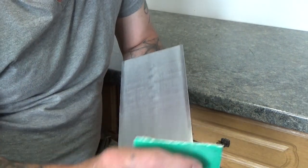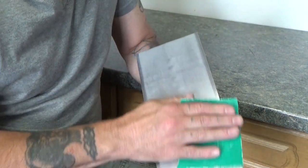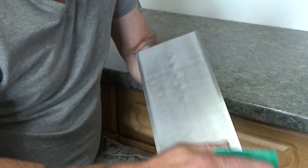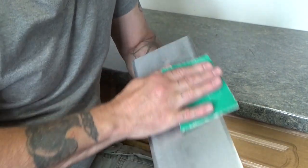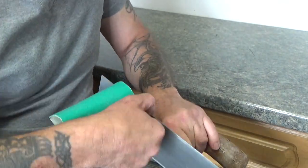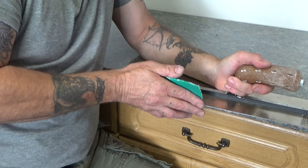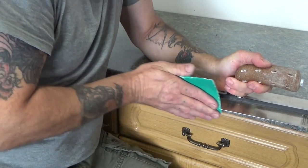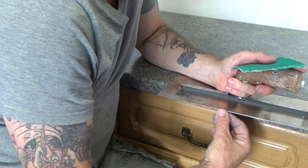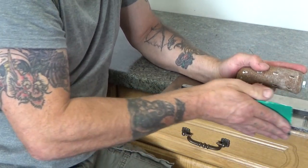You've got to make sure it's continuous strokes all the way down the edge. Keep it flat on the edge, backwards and forwards the full length — that'll take the burrs off. Then rub your thumb along it and you can feel if there are any more burrs. There's one there still, so it needs a bit more just to get the burrs off.